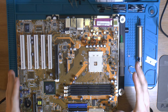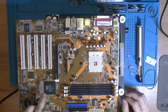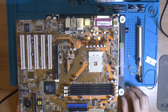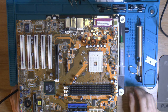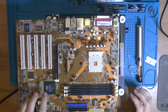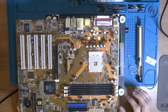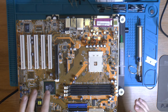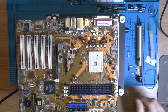The board is on the board heater here, and I removed the heatsink here. And I noticed that this is an nForce3 motherboard. So that is kind of nice because it should overclock better than the VIA boards. The VIA boards usually do 218 or so from the stock 200. So you can take a 1.8 GHz CPU up to about 1.95. From what I checked, this should do over 240 MHz bus. So you can probably push the CPU up to about 2.2 GHz because usually you're limited by the chipset here rather than the CPU. Let's flip this over and remove all the caps.